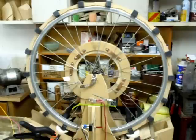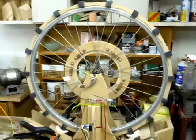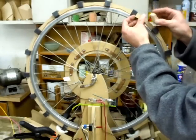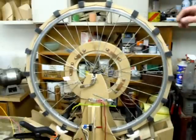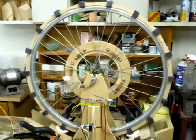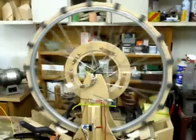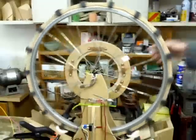Then I glued the magnets crossways with super glue on top of those, and cut these wedges and glued them in opposing one another to create a wedge. So these guys are glued in there real nice. I don't think I'm going to have to worry about them flying off, plus I'm really not doing huge RPM — I'm in the 200-300 RPM range, even the 150 range really.